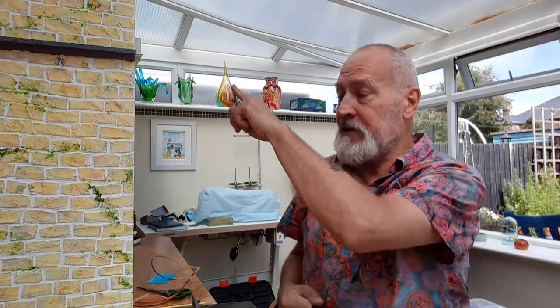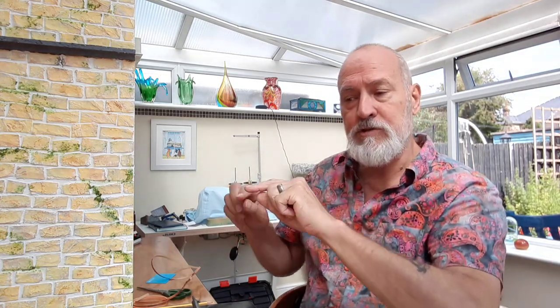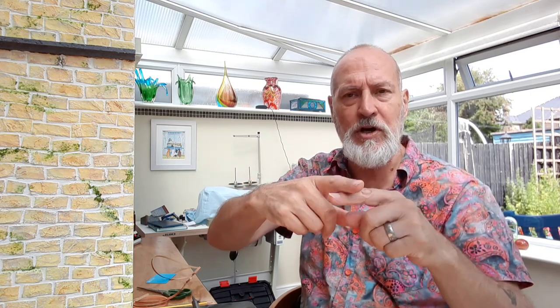So I'll just carry on. I'll finish this tape. The copper tape that you put on, what I'm doing is, before I join a bit onto another bit, I put a bit of solder on that copper wire on its own. Then I get the other tape and stick that onto it, and then I do another blob of solder on top of that to give it a good connection. If you just stick the tapes together without soldering them, then sometimes you don't get a very good join.